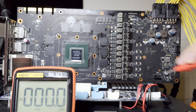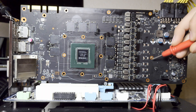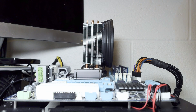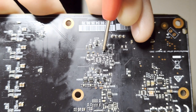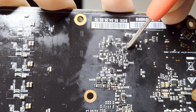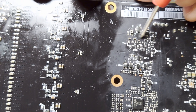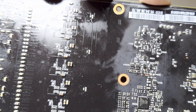It's not supposed to be zero volts - there's supposed to be a voltage difference. We have to trace why we don't have 10.5 volts on this pin instead of 12 volts. That 10.5 volt signal connects to a via on the back of the board, which connects to a resistor, which connects to a diode whose cathode end is ground. The idea is that this diode shorts the 12 volt gate signal after the resistor so it drops to about 10.5 volts, creating our voltage difference. However, for some reason it's not being shorted. Let's look at it under magnification to see what's wrong.